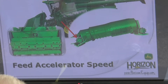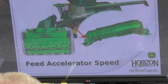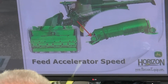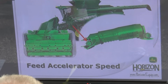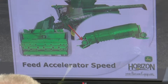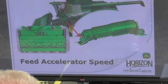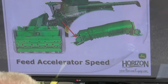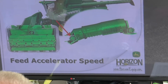If you're going faster, we probably need to run that feed accelerator faster, because we're going to be spinning that whole machine faster in order to keep it full. That could be in corn or beans depending on the situation. If you're running fast on beans, running it fast helps with bunching in front of the rotor. Running slow on corn is the general approach.